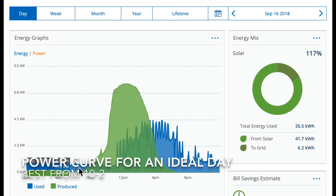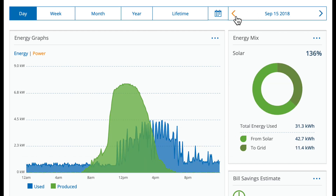I wanted to spend a minute and talk about how reliable solar power is. I like it because it's solid state — there's no fuel source you need except for the sun, and that's really the big variable. A typical perfect day shows a power curve similar to what we saw today without the afternoon drop-off. You can expect four to five hours of really good sun — so 80 watts per panel on a perfectly sunny day for maybe five hours on the high end, then a little bit of energy on the tail for up to an hour additional.